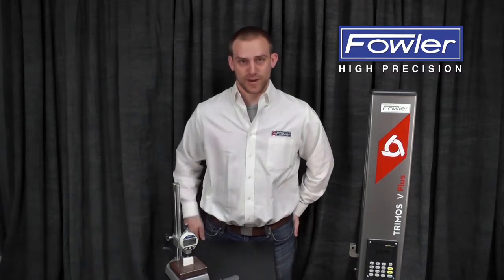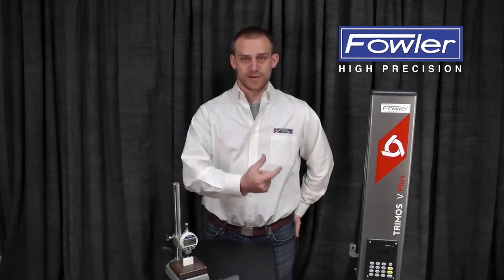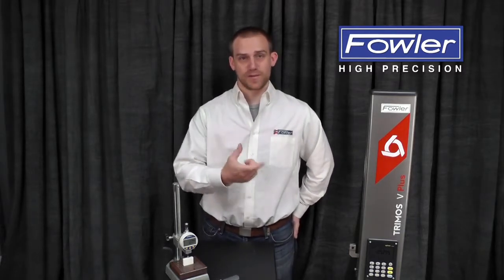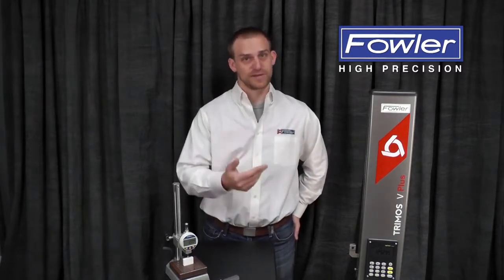If we have a nice repeatable measuring force, then we're going to have a little bit of flex when we take our reference measurement, or our zero, and every measurement we take after that is going to have the same amount of flex, and thus will cancel out the initial.